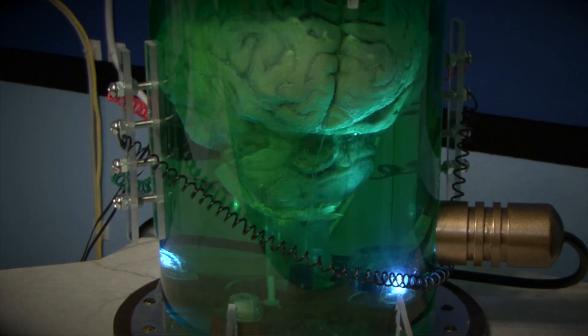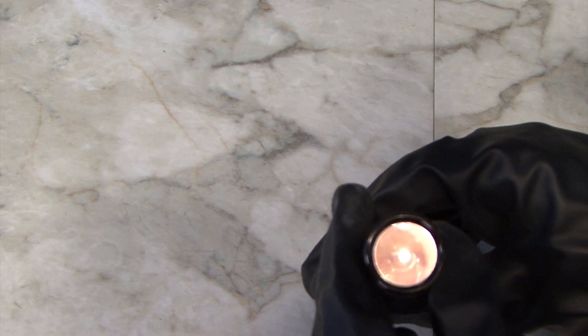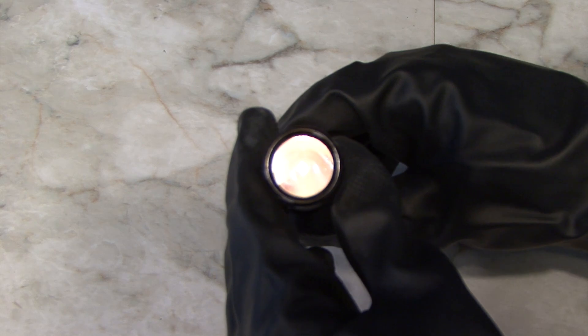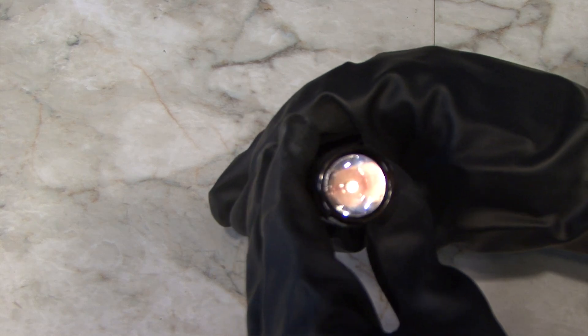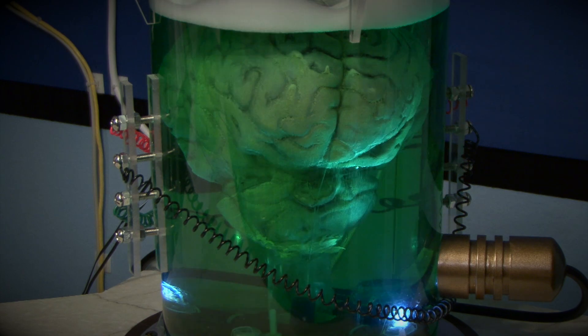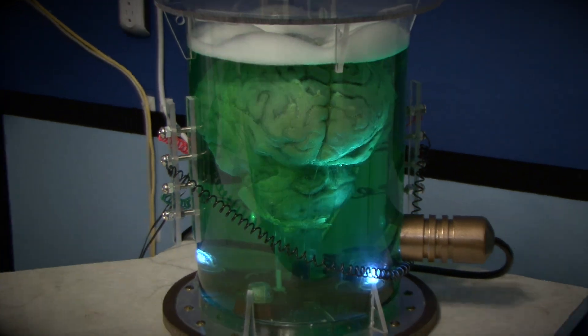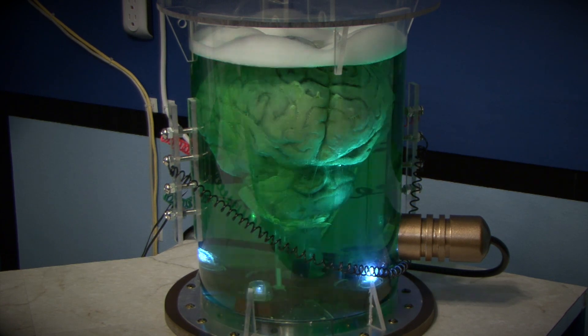Oh, we're back. So, how did the test go this time? Well, in our standard control test, the batteries were drained until the light became dim and the voltage dropped below 1.25 volts per cell. This gave us about 2.5 hours of bright, usable light. After recharging, I was able to get another hour of bright light before it became dim again. So, by doing a more shallow cycle of the battery, you were able to reclaim about 40% of its original capacity.